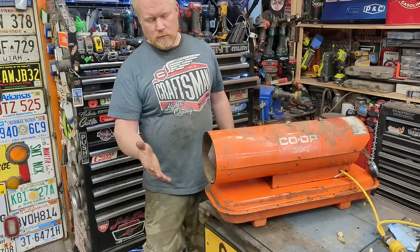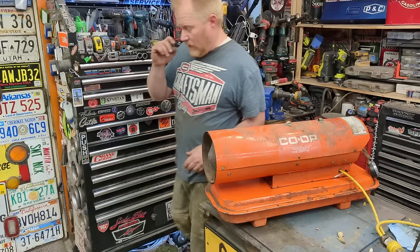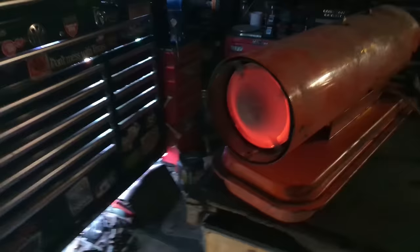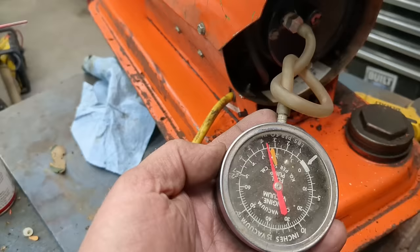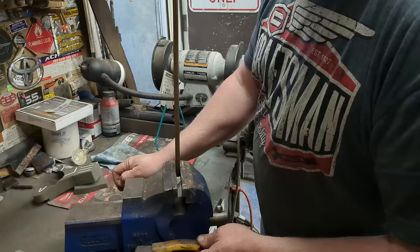See if it fires up right away — oh yeah, putting out some nice hot air. That smells like mouse though. That's what your cone should look like — exactly like that. You're burning clean, burning lean, and there's no smell at all. Roughly 3.6 PSI is about right for this one. You should just be able to walk to the front and not smell anything, just warm air. If you smell something, your pressures are wrong — and every single unit will have its own pressure listed on the side.